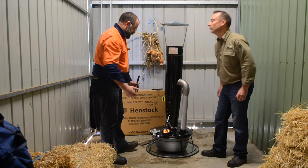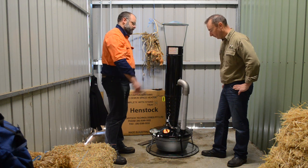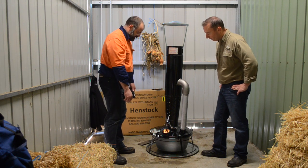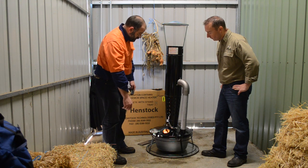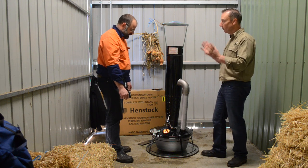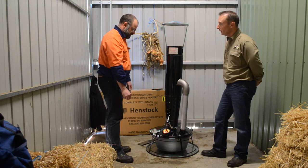Sometimes the fuel that people get is not real good at lighting, so it takes a little bit longer the first time. Always after that, once it's sooted up — and you should burn it for about eight hours or so the first time you light it — run it in properly and then she'll burn really good. As you can see, that's taking a bit longer than normal. There's a perception that you just light a match, drop it in and away it goes, but you need to nurture that burn to start. It's much quicker the second time.